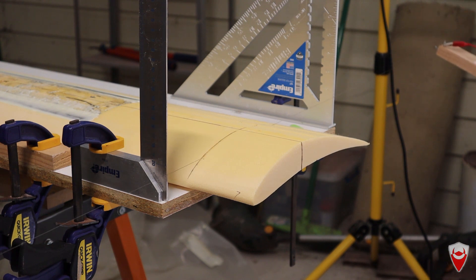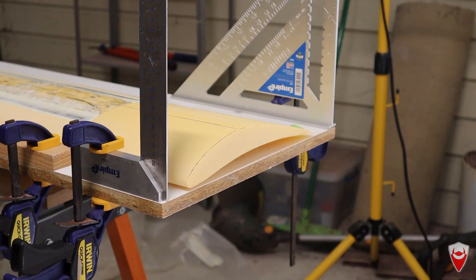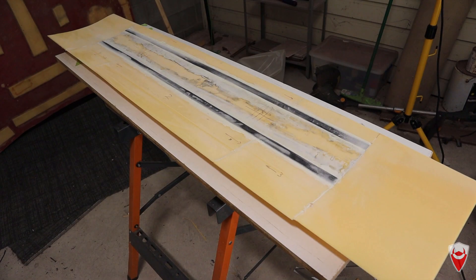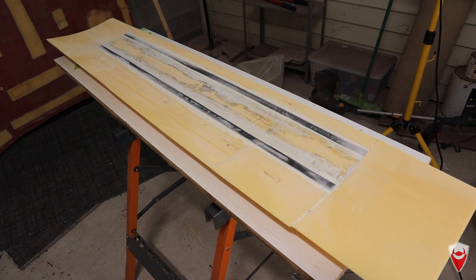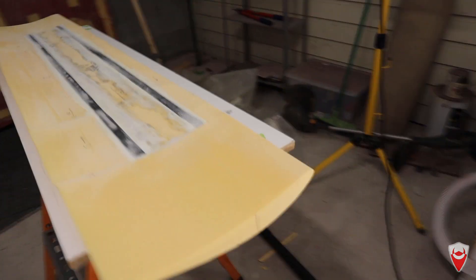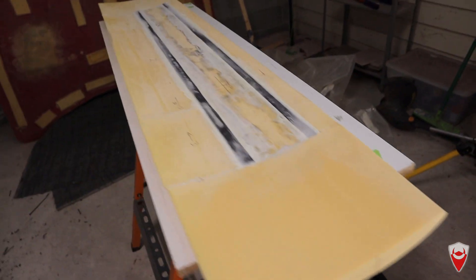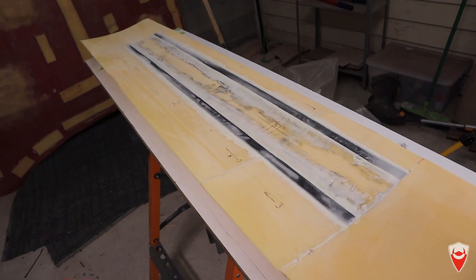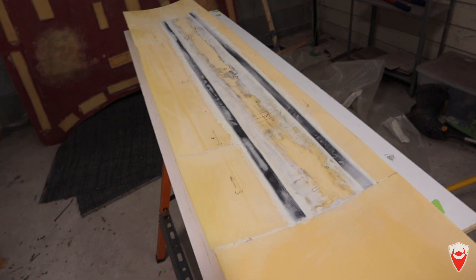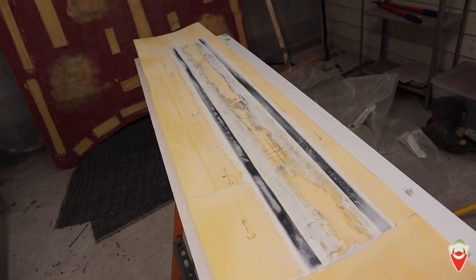This is probably a cop out, but I'm really glad I made my hot wire cutter nice and janky so I can just pick it up and use it like this instead of building it into a bench. The wing here has had the top surface all faired off, it's cut to the right length, all the edges are squared, and I've got marks to find the centre line so I can pick up the mounting points on the bottom side of the wing. Everything is set for the top surface to be given its first couple of layers of carbon.